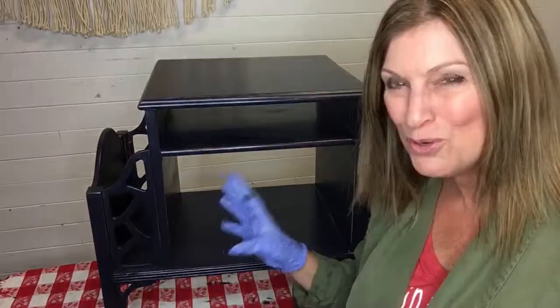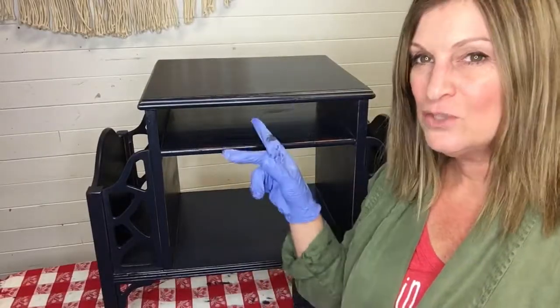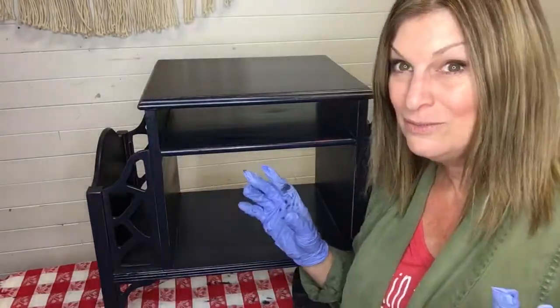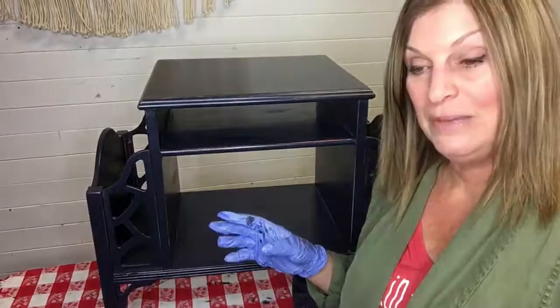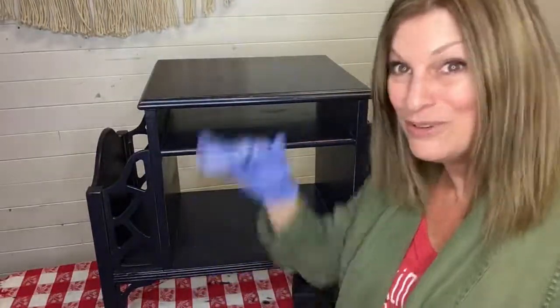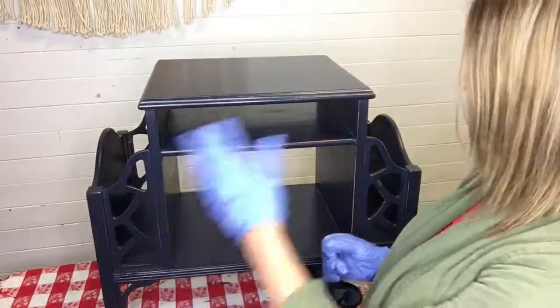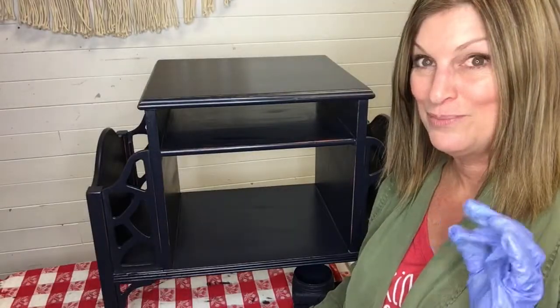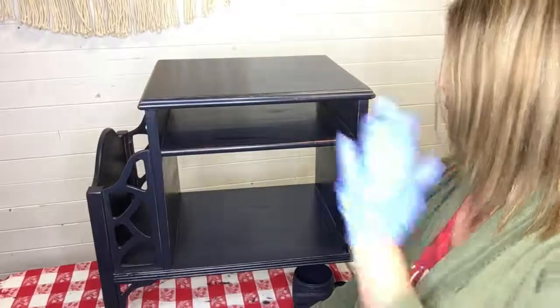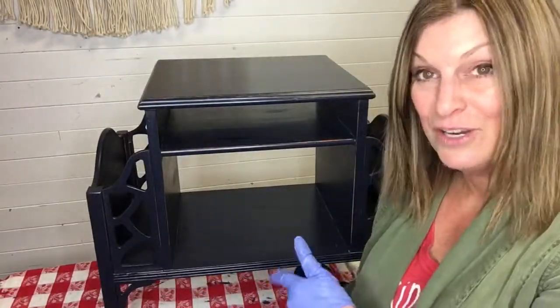That's going to take a little while to dry. Unlike with the wax piece — which you can't really hurt if you touch or move it — with this top coat you don't want fingerprints on it. It's delicate. Leave it alone and let it dry for at least an hour or two before you even remotely touch it. Even then, give it some time to cure before you start putting stuff on top. I tell my clients to try to give it at least a week before putting things on it — it takes a few weeks to fully cure and reach its maximum durability level. Super easy though — I definitely recommend the sponge, don't overwork the product, and you're going to have great success. See you soon!